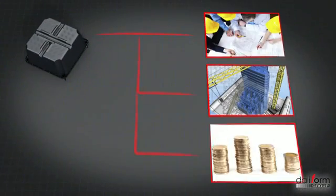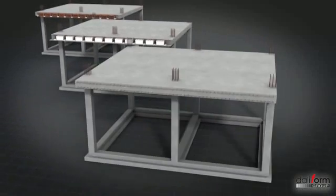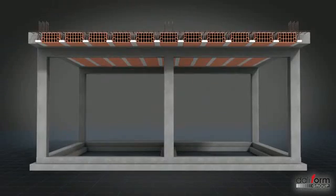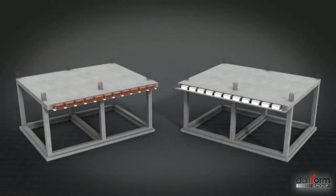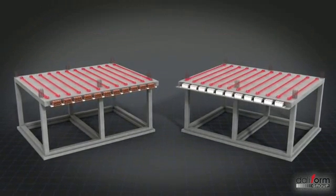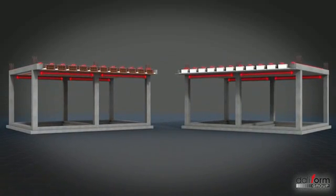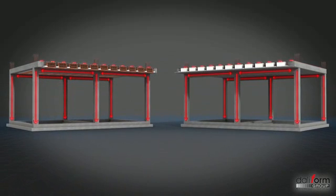This solution affords considerable designing, technical and economic advantages compared with the traditional clay or cement systems, those in lightweight polystyrene or fully casted two-way slabs. The traditional clay or cement or polystyrene floor slabs normally consist of monodirectional beams that discharge stresses onto the main beams, from these to the pillars and finally to the foundations.